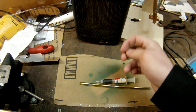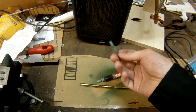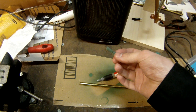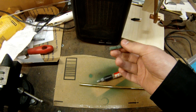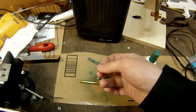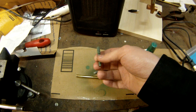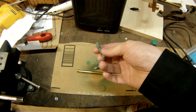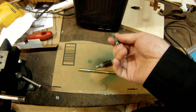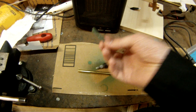It's very unlike the oil-based lapping compounds we're used to, and the reason is you spray this on and you don't actually really need to reapply it. It sinks in, it bonds, it sticks, it doesn't contaminate the barrel. You can just run a swab down it afterwards, just one pass, nice and tight, and that'll get everything cleaned off, and it just doesn't rub off. It embeds really nicely, so I'm pleased by that.